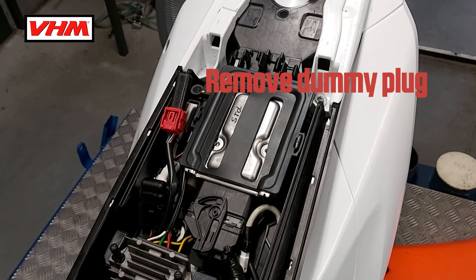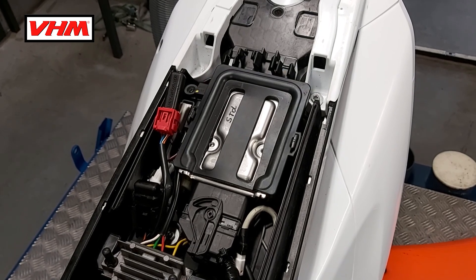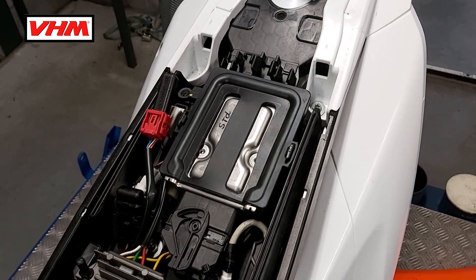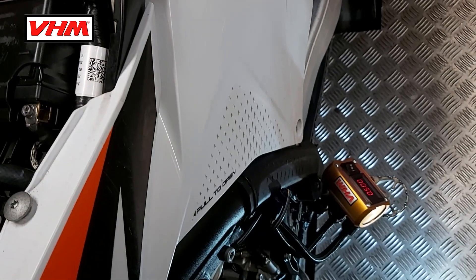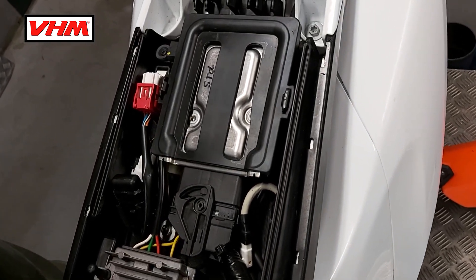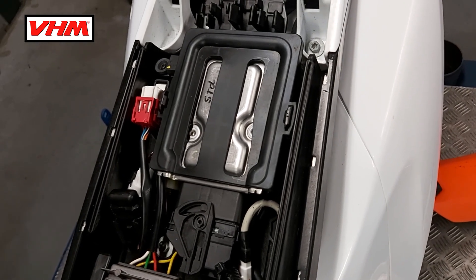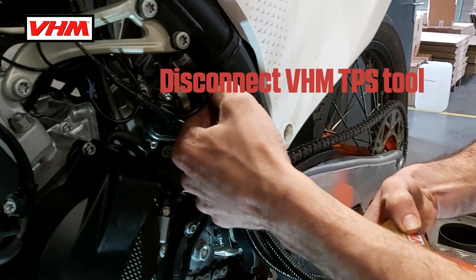Now the three levels of sensor voltages are adjusted. It's not possible to disconnect our tool when the ECU is on, so we need to get it back into sleep mode. This is easily done by removing the dummy stick and waiting a few seconds for it to go into sleeping mode. Take the dummy stick out and put it back in its position. You can see that the tool has switched off — it just shows the hour meter, which is an easy check. Now we can disconnect the tool from the wire loom and get the sensor connected back on the wire loom.